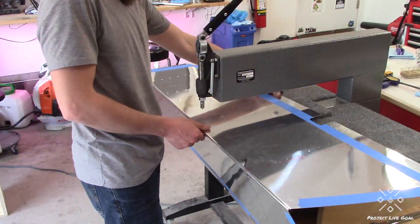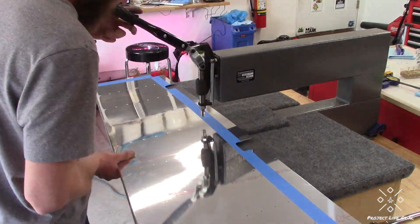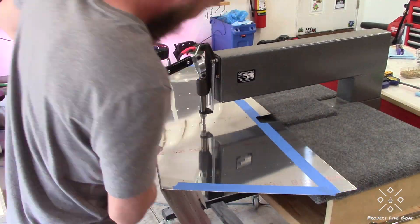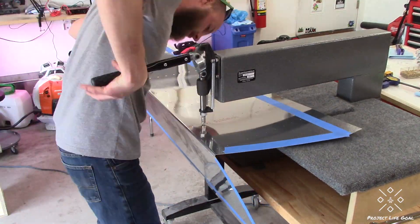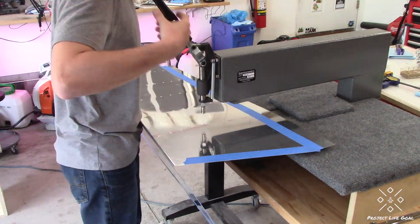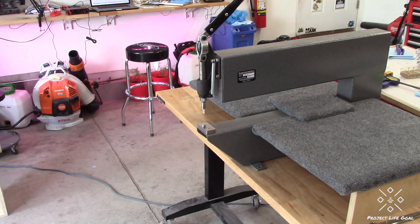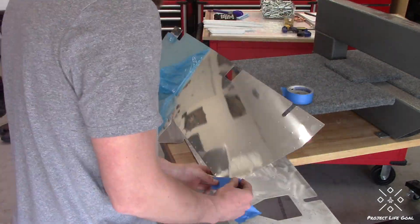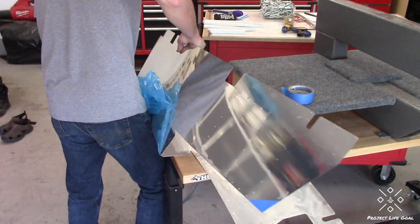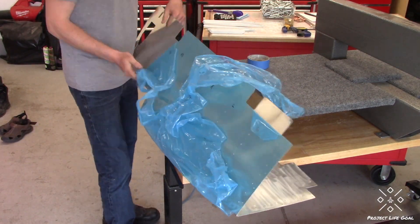While it is definitely awesome of Vans to do a majority of the hard bending for you, the dimples towards the trailing edge of the elevator are a little bit more of a challenge than the previous parts — the skins for the horizontal stabilizer and the vertical stabilizer — but not too terribly difficult. If you've got somebody that can give you a hand holding the piece, that would definitely make the process a little bit easier.